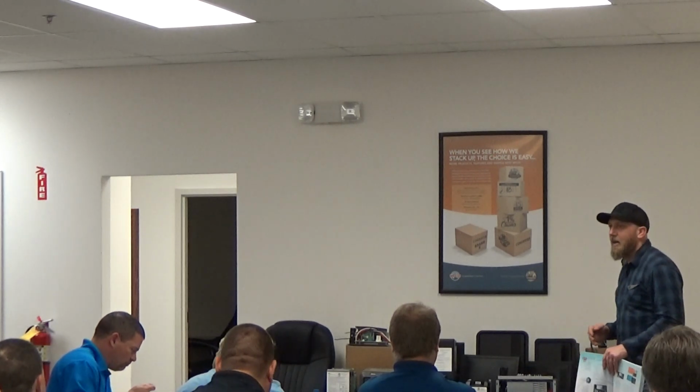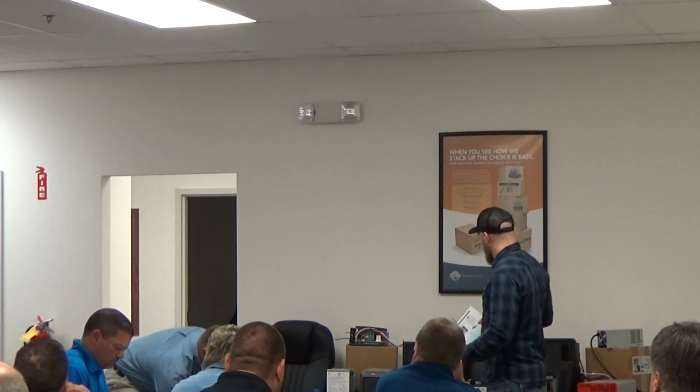Definitely. When it comes up with the 9900, we do sell 9900 MBAs, so just like every one of our other products that you can swap out the MBA other than the 8700, which is in its own little class. There are main boards, so they don't have to rewire the whole coach to replace the bottom section of it. The 99 is also a 50 amp service panel. That's all in one, so it has the converter, the AC slots, and the DC fuse board all in one package. It just doesn't have some of the added on features like the 9500 and 8500. Doesn't have the incoming LEDs, nor the full load indicator.